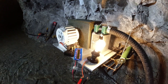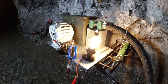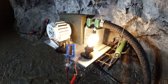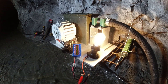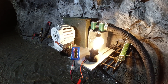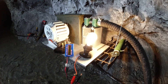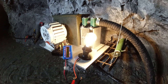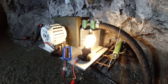I've got some good news. I took the lid off and had a play around with the nozzle inside to get it aligned as efficiently as I could, and I managed to get it turning a bit faster just by getting it pointing as optimally as possible. It is producing a bit more voltage now, a bit more power — though still not an awful lot. That 10 watt light bulb there, it's lighting that up no problem, and it hasn't really slowed down much with it connected, so it's definitely making more than 10 watts. I'd imagine it's about 20 — that's about what I was hoping for.